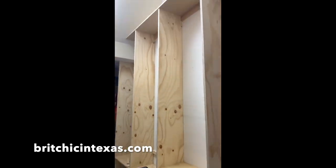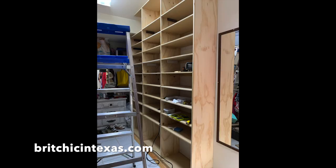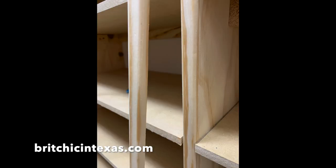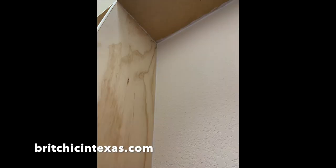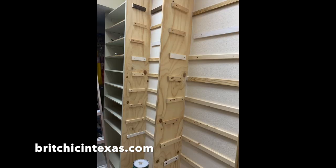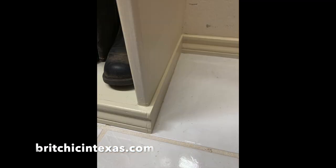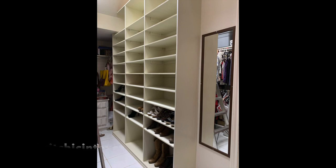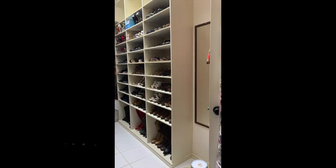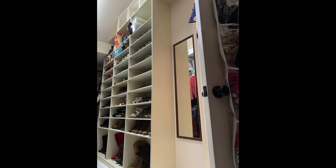The first row of shelves was done — they're higher for boots. I repeated that process for the rest of the 27 shelves, then added a little trim to cover the edge of the plywood. Then it was caulk, paint, install — caulk, paint, install — which was quite time consuming. After reinstalling the baseboard and putting the shoes up, the finished product turned out really well. I'm really happy with it — it turned out to be a lot of storage space. Thanks for watching.